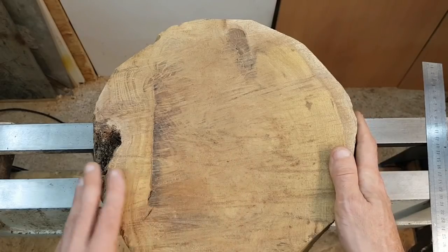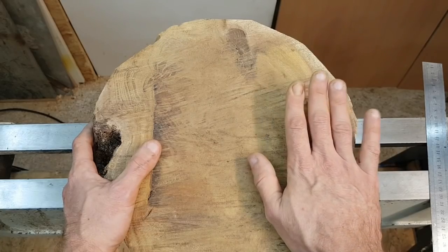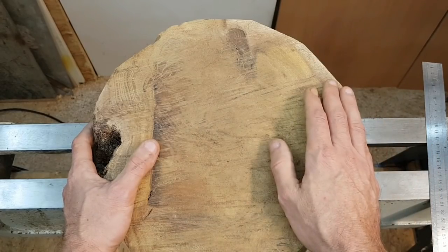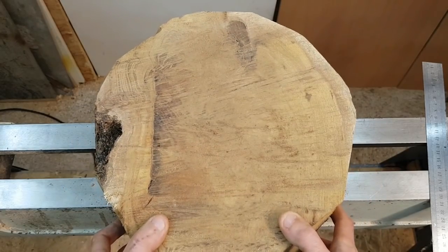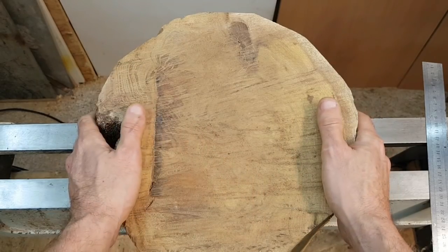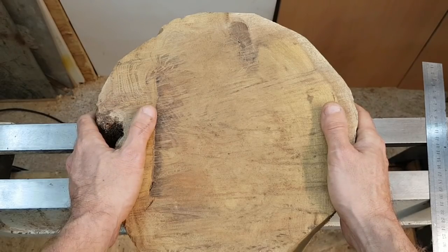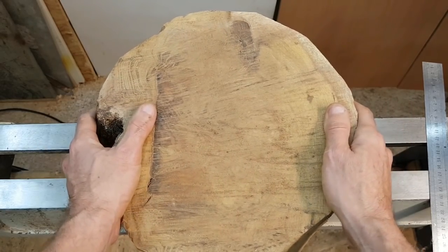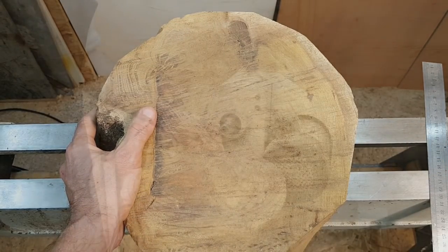We also have to remember this mulberry is quite dry at this point. I don't know if it's dry all the way through to the center, but it's going to be really hard on my tools — I'll probably have to sharpen them a few times during the turning. Mulberry when dry is really hard to turn, but the plus side is it's going to take the finish really well. Without further ado, I'm going to go chop this up and be back right after the cutting.